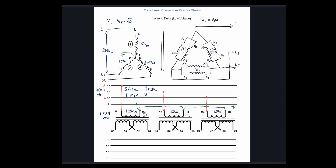Those secondary windings correspond to these single transformers. With these transformers, the ratio of windings from primary to secondary actually ends up being root 3 as well — we have 1.73 times as many turns on the primary as on the secondary. So our secondary voltage is going to be 69 volts, as we saw in the previous videos. That means this voltage is 69, this is 69, this is 69 — everything is 69.